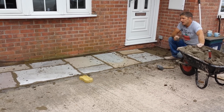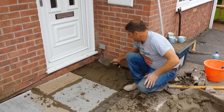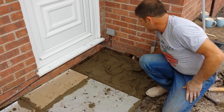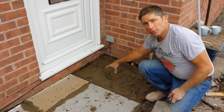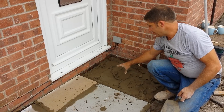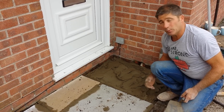It's called the Promenade and it's got various colours on there. What we've done — which is important for longevity — is level the bed of mortar we're going to lay on as flat as possible. You will without doubt have some voids underneath, and that's intentional: when you push the slab down, those voids get filled up. It's like tiling when you use a comb on the back of a tile — when you push the slab down, that mortar goes into the void. It's not spot laying; it's a fully supported bed, and it works.